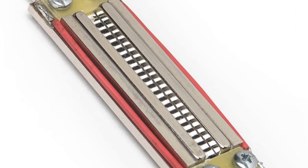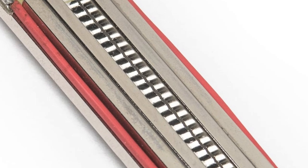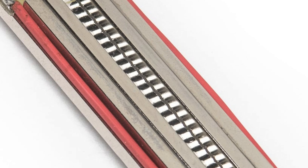A little history about the ribbon mic. The ribbon mic was invented by Dr. Walter Schottky, who obtained a German patent issued December 21st, 1924, with Siemens and Halske in Berlin. The armature of the mic is a light, corrugated ribbon of aluminum alloy, in fact 2.5 microns thick for this kit. And that is thinner than a human hair.